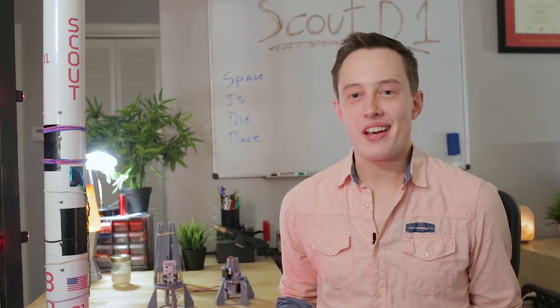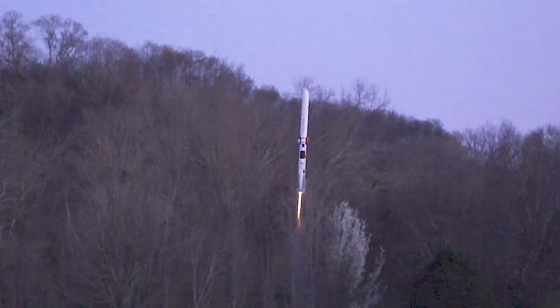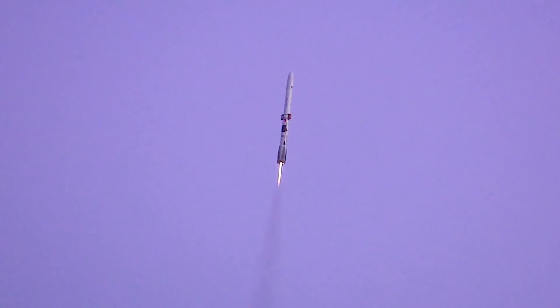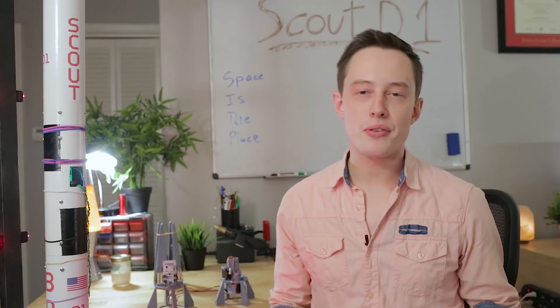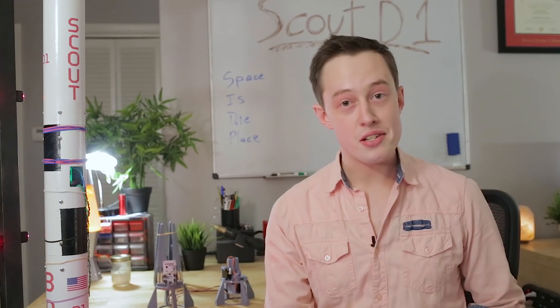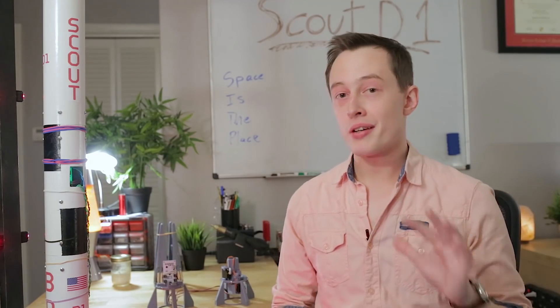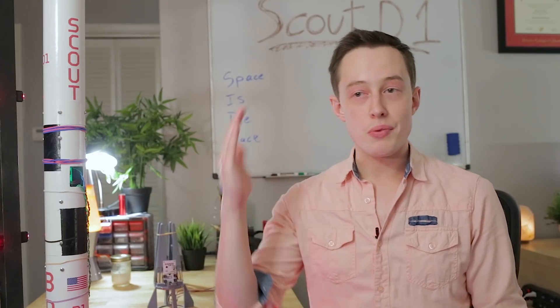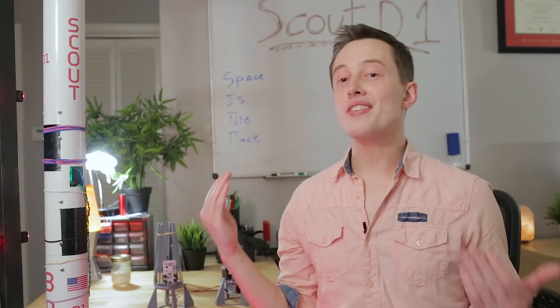All memes and jokes aside, we've got a couple of questions. First, why did the rocket tilt over when it launched? You'll notice that it was pretty stable, yet it was not at an upright orientation, but rather pitched over as it continued upward. There's actually an interesting reason for this. We have to look at how the Signal flight computer actually obtains orientation measurements. Essentially what we do is resolve pitch and yaw on the vehicle by looking at the gravity vector on the accelerometers.